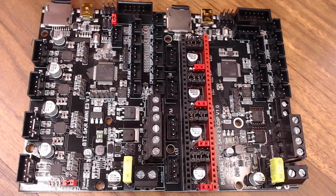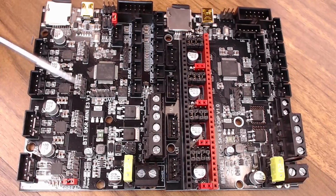Both these boards are designed to use that one connector type LCD screen. On the Ender 3, it actually does have 3 connectors, but you want to use the EXP3. In the Marlin configuration, that is what they call the CR10 stock display, if you want to know what to select in the firmware. Now both of these boards should work exactly the same way.